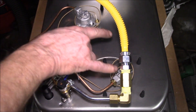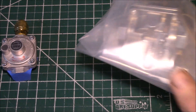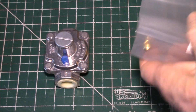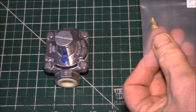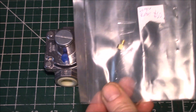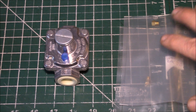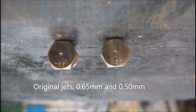The jets and regulator came in — I just got these in the mail from Frank Hamilton. So we've got two burners here: a small burner set up at 1 millimeter, and then the larger burner at number 60. These are the two jets or orifices for my two-burner stove to convert from propane to natural gas.